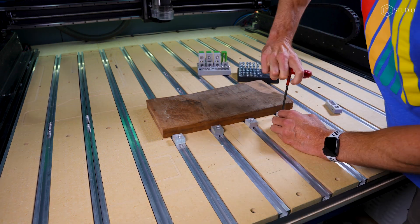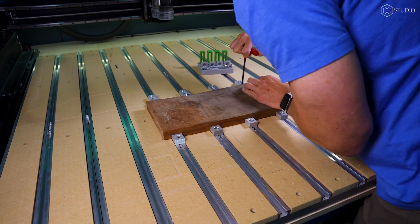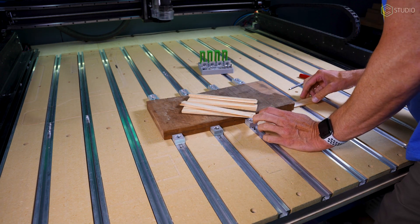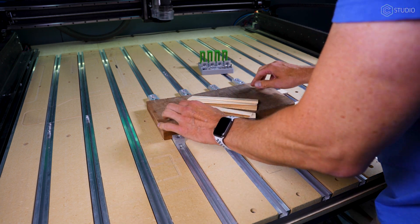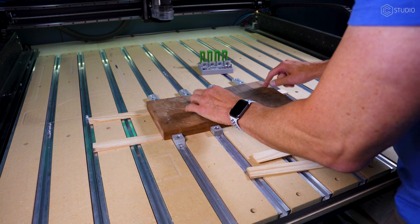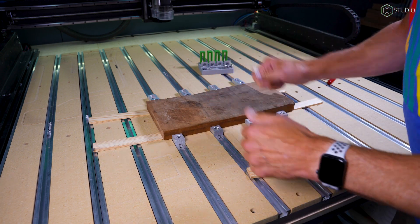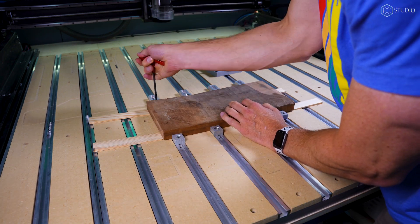Because of this, we'll need side clamps. Here I'm using our Crush It Pro clamps from the sides. I'll put the stops in the front and the clamps in the back — you'll see just how out of control this board is. To fix that, you'll need some wooden or plastic shims, available for a couple of bucks at any big box store. Slide them underneath and tap the board to see if it's moving. Just slide them to where they touch — don't lift the board up. You want the shims to prevent vertical movement by supporting the board.